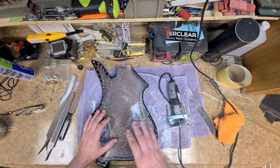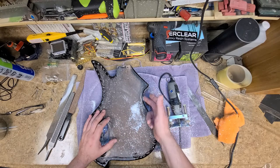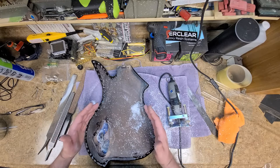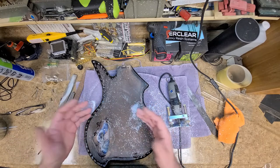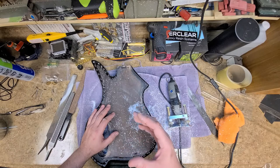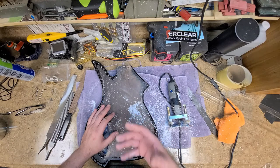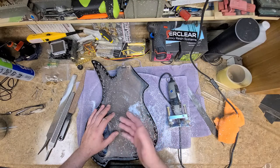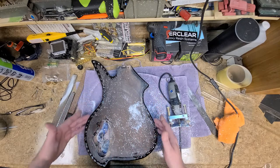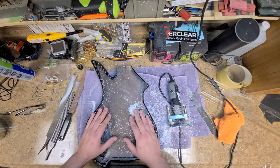Like I said, the blue tape did not stick around the edge when I made my drip skirt around the edges when I poured the top - it just peeled off. The heat from the epoxy resin as it's curing loosened up the blue tape. That's why I prefer the green tape a lot better. I would not have had this problem if I had the green tape, but I didn't have it.